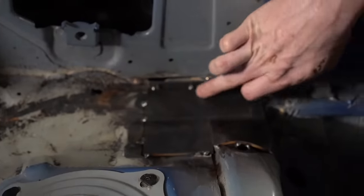I knew that I had to pull this over with this strap so that I could fit my intrusion bar up in through these two holes that we've bored. So I didn't want to fully weld everything. It would make it just that much more rigid and harder to do. This already has a ton of tension on it as it is. And this tube is barely going to fit up in there, but this is what we're going to attempt here. I've already drilled the holes and we've just got to line them up and get them through with some persuading.